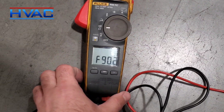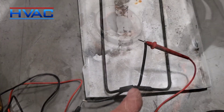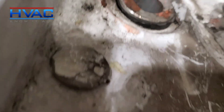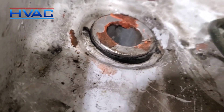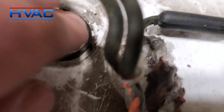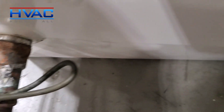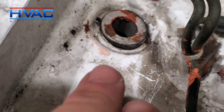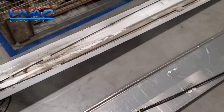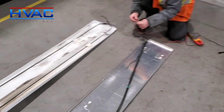We're reading twenty-four point seven ohms. Let's compare it to the new one. The other thing I'm noticing is that the gasket on the drain looks compromised — it looks like it's been torn and compressed too much. This could also be a point where it's leaking, running down the evap and dripping in different spots. I'm leaning towards this at the moment as being the problem.